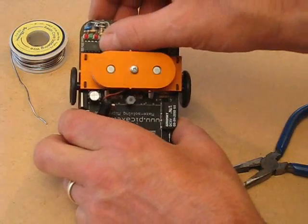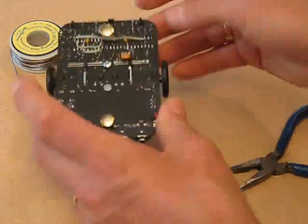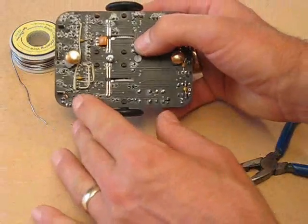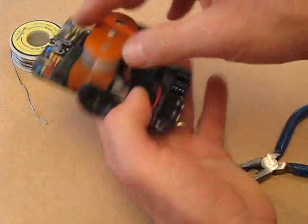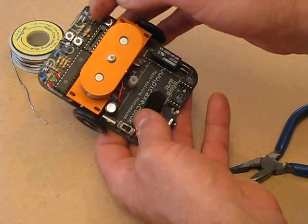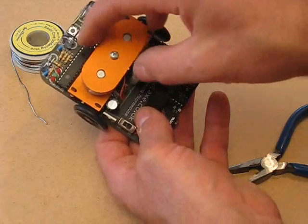I've put the 28x2 in and the 10MHz resonator. I've also added three wire links which will allow the 28x2 to control the button and the two LEDs that the 18x were controlling.